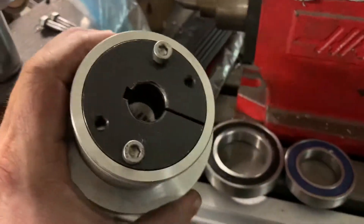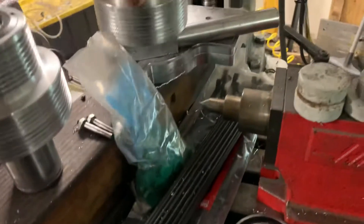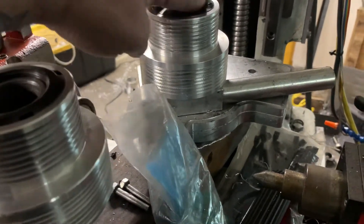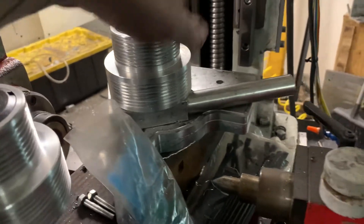We have both that and then we have a taper lock pulley set — so this is an eight-rib. I don't know if I'll make them eight-rib anymore; I'll probably go with the micro-V, an A and a six-rib. And then I'm going to be making a timing belt in the 8M — eight millimeter, twenty millimeter wide. Let's go see how this machining works.